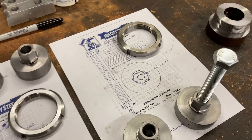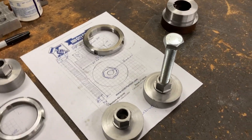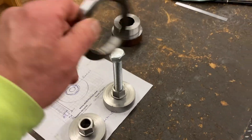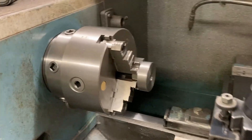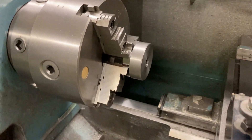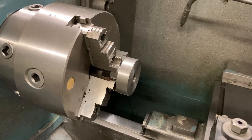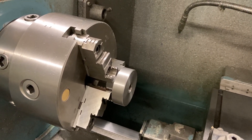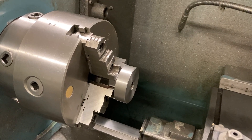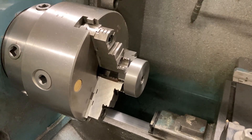We're going to make three of them at 65mm and two of them at 60mm. I don't have ring gauges, so we're going to use these spindle nuts to gauge the thread. We'll stay away, cut the thread staying a little big, check it with the gauge — if it doesn't go, make tool adjustments. Keep cutting until the gauge goes. When the gauge just goes, we'll take a couple extra passes. On a 2.0 pitch thread, there's probably a few thousandths of tolerance anyway. Once the gauge goes and a couple extra, we'll call it a day.